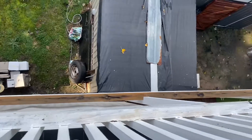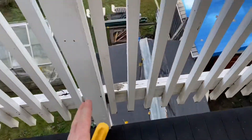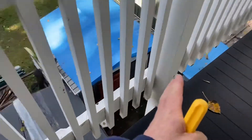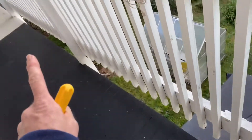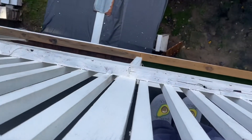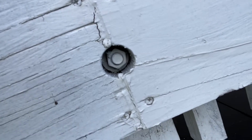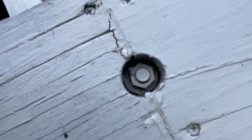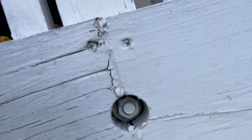I'm going to have to undo that one to get this part out because this one needs to be replaced. I'm going to do it so that each section will have a rail, and I'll probably work from that end and come along so they can basically overlap easier. Notice this one's just two butt joints, a couple of screws, and a bolt in the middle — barely holding — so that's why I want to do the overlapping half lap joints.